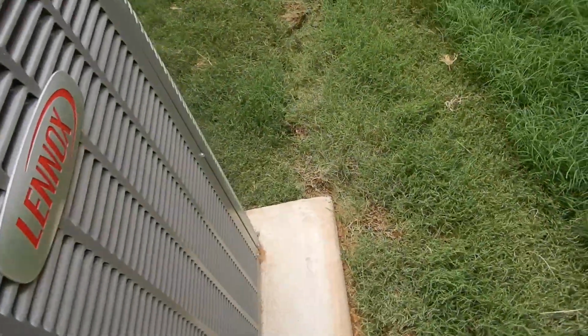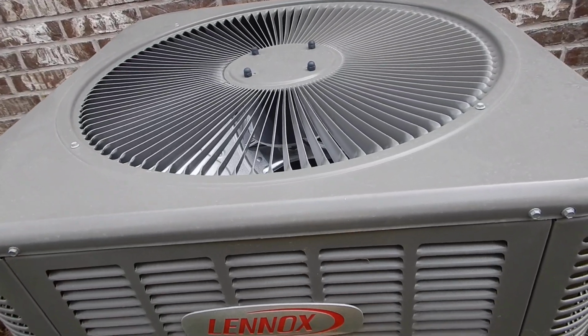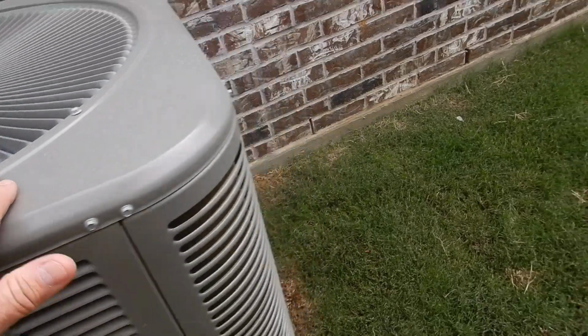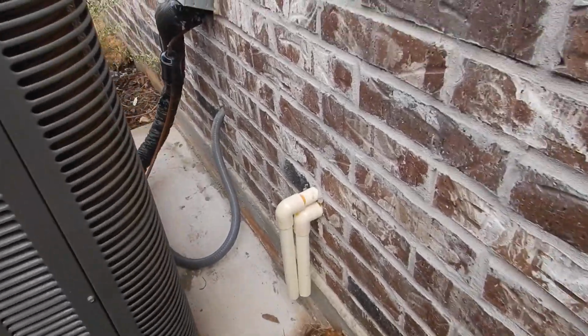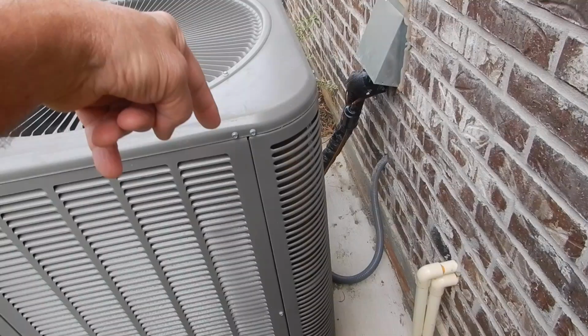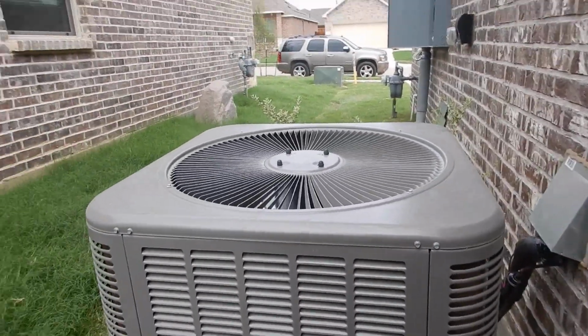Overfused means that this breaker will not trip in a timely manner while the condensing unit is running in critical mode. While it's in this critical mode, running too hot to prevent it from doing damage to itself, it's still not going to turn off because you have a 30 amp breaker. The system is rated for a 20 amp breaker. Breakers work on heat. So this is overfused.